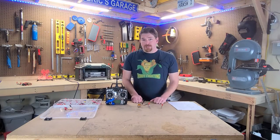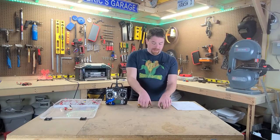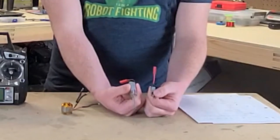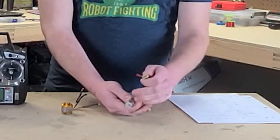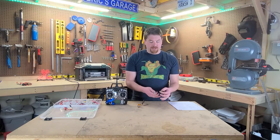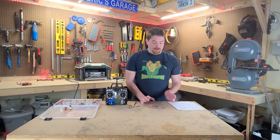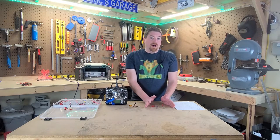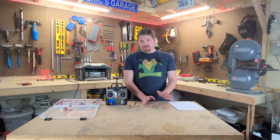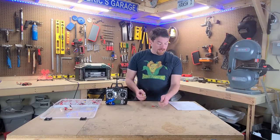Past that, we get into the different types of motors. When talking about brushed motors, we're talking about these types with the twin cables coming off them, usually with electrodes you have to solder to or put a plug on. These have a gearbox on them, but are usually cost-effective and have considerable weight savings because you don't have a huge number of magnets compared to brushless. Brushed motors tend to be used for your control drive — the actual movement of the robot.